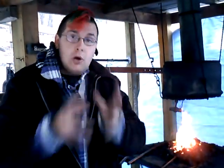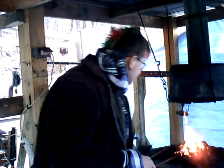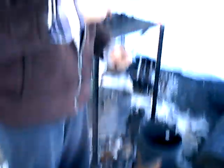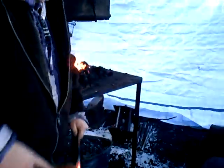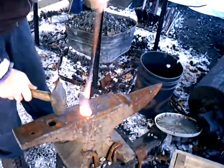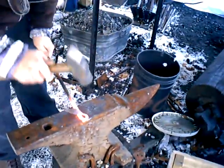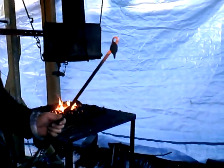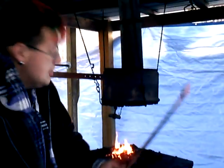One more heat. I'm going to turn the air off — I don't want it to get too hot. I'm going to grab a pair of pliers. What I'm going to do is twist it. I'm going to make it look like a natural curly leaf and that vein that comes off the leaf right here — that's what I want it to look like. So I'm going to start over the tip of my anvil, take my pair of pliers, and give it a nice good twist. Just like that. Perfect, I love the way that looks. So now we're going to heat up this section right here and prep it for a hole. I'm going to drill my holes — I think it looks a lot cleaner than punching the holes. So we're going to do that next.